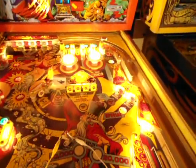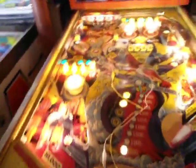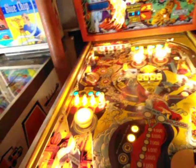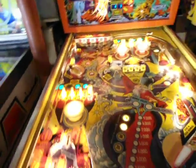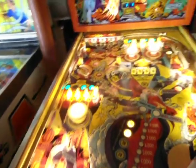What I like to do is get a known working socket and bulb, brand new, with 2 alligator clips, and get underneath there, clip one on each, and see if it lights the bulb. If it does light the bulb, then you've got a bad socket. If it doesn't light the bulb, then you look elsewhere.